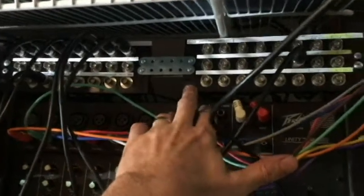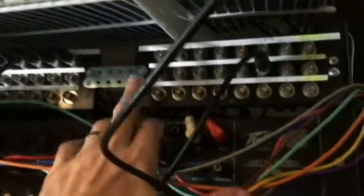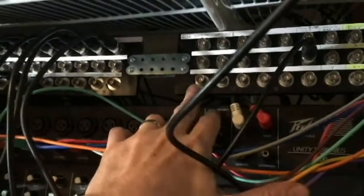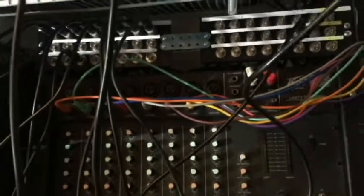So this is the BNC patch bay that I put together. If you ever want to do something like this, don't buy the ones that are for video. I made that mistake. You want to get the ones with an acrylic or plastic base or face to it. You don't want to share grounds when you're doing this stuff for music, because I discovered this when I was doing a smaller setup where I used direct boxes to condition the signal so it doesn't blow anything up. And just by the direct boxes touching each other, there was this weird ghost or bleeding going on between the tracks, and it's probably harming the equipment and causing all kinds of problems. So you want to keep the ground separate. That's why I use BNC more than banana, if I can help it.